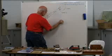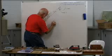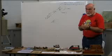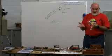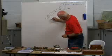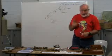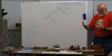And for most of these tools, that cutting angle is usually about 45 degrees. Because I'm a professional engraver and have to engrave lots of different materials, I find I'm engraving modern materials like stainless steel and titanium. And I find that if I'm engraving these harder materials like stainless steel or titanium, I might find that I've got to increase this angle here maybe to 50 to even 55 degrees. In other words, I'll make that angle of cutting a little steeper and therefore a little stronger. So you can see, there's a little bit to be learnt here, and there's a lot of fine tuning that one does as one becomes more and more experienced.